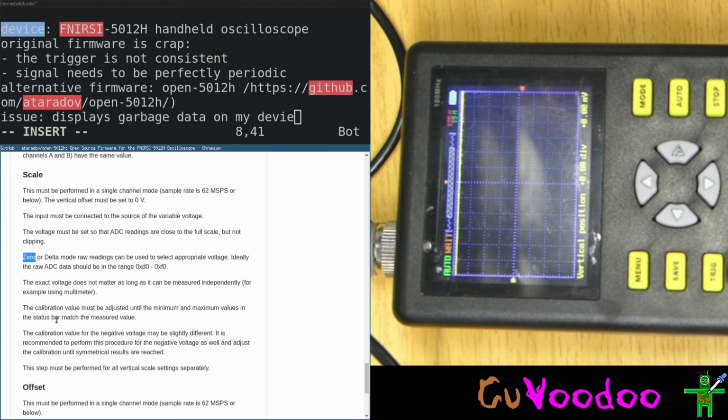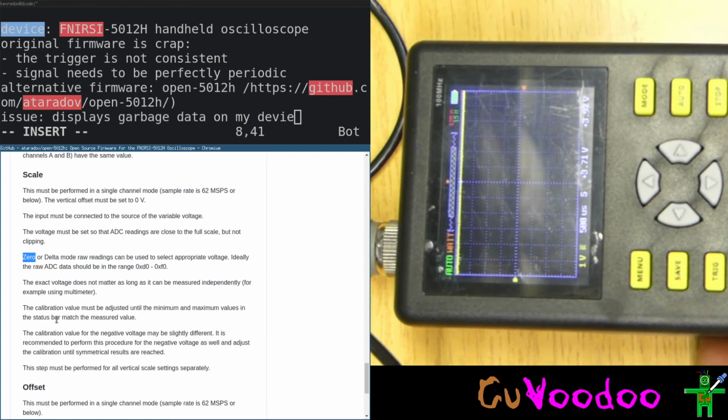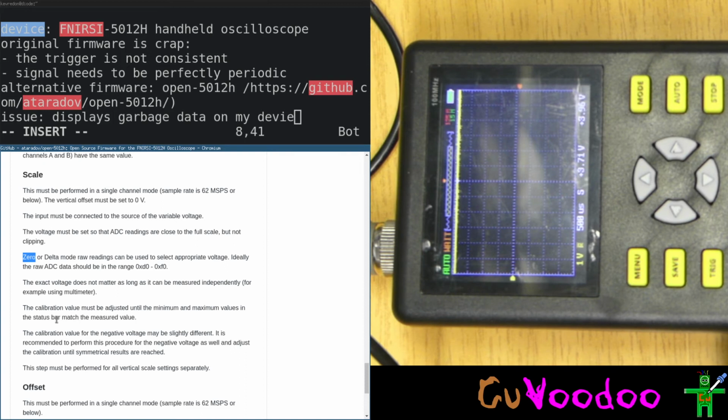That's the position. I cannot change the values again. How do I change the values? Did I miss something? It is closed though. I'm outputting 369 volts, 370 volts, and this is where it measured. Let's use the multimeter for an exact reading. And it says 369. And the oscilloscope shows 371, which is, for me, close enough.